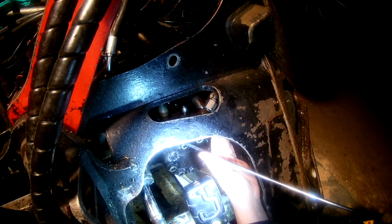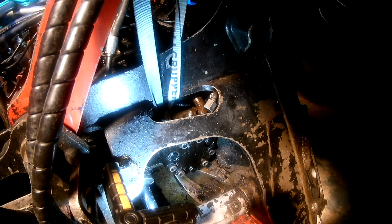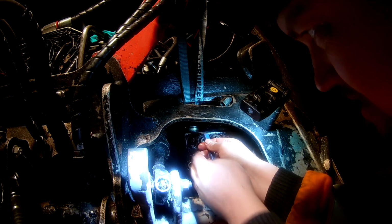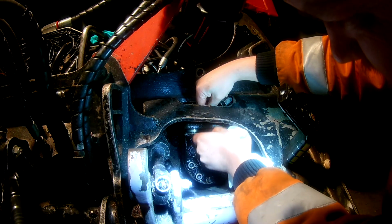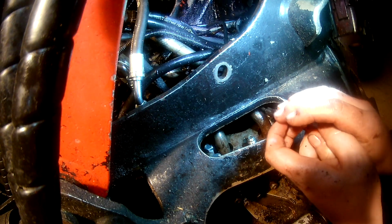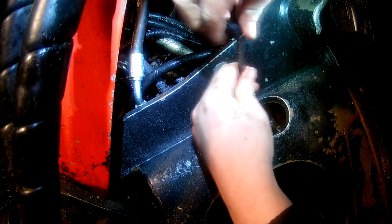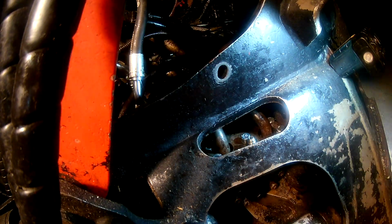So here I'm having a break. Now I'm back, and I started cleaning up around the other motor. Same procedure here, bending up the pipe slightly and removing the old seal and using a small spatula to put the new O-ring in place, ensuring I don't forget that third O-ring in there. Also here very little room, and having a little pair of pliers to help get the bolt down. And eventually, I think these two motors were the hardest part about this, getting the clamps on them undone.